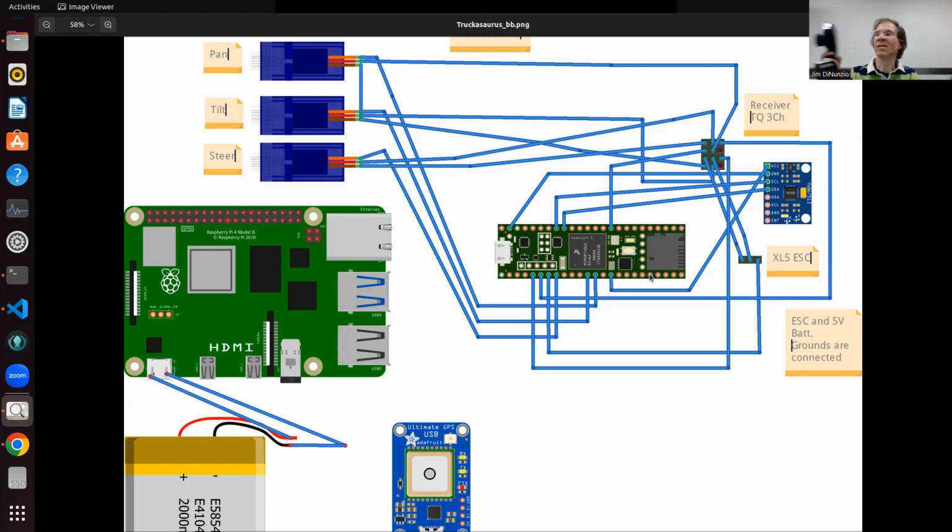But in this contest, I'm trying to make the software so that if a child runs in the way of the robot and you stop it, then when you clear the scene and resume, the software must be able to resume without getting confused. That I'm working on. In ROS, it's going to be an emergency stop topic. I don't know if I need that yet, but I'm going to publish it because it's easy enough, so that the system knows when emergency stop is activated.